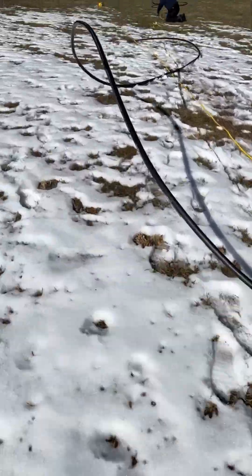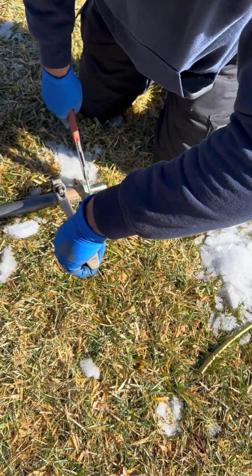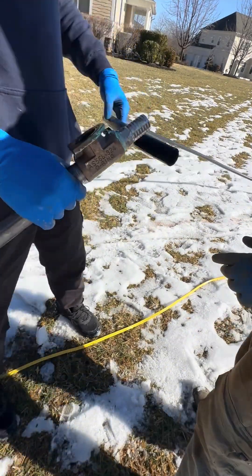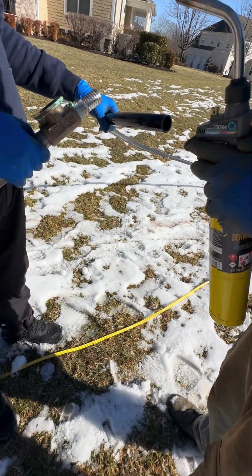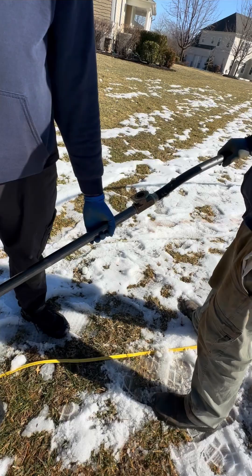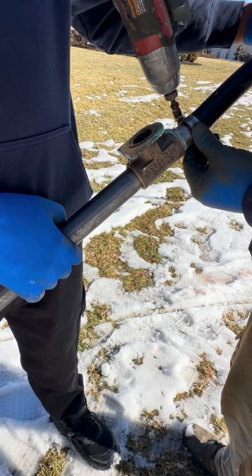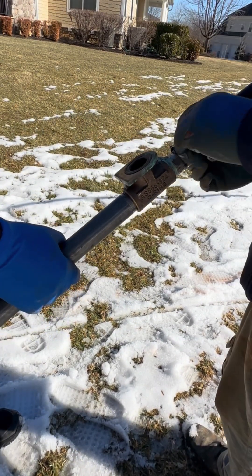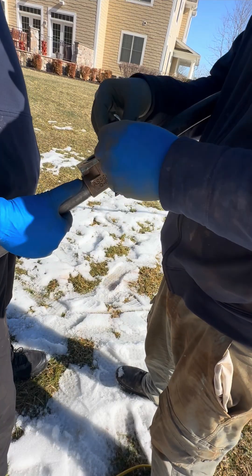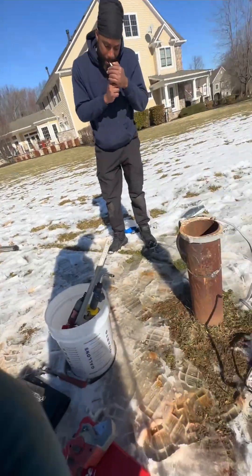As you can see here we got our long pipe, and now I have my man up here. We're gonna put a new barb fitting on the pitless adapter. We're gonna heat this one up and shove it in — teamwork makes the dream work. I'm typically doing shallow well jobs like this myself, but we're teaching people how to do things around here. We're gonna get this nice and tight and then I like to add a bunch of tape around the hose clamps because you don't want those things corroding.